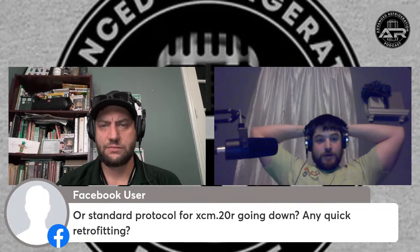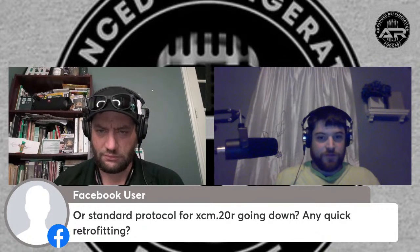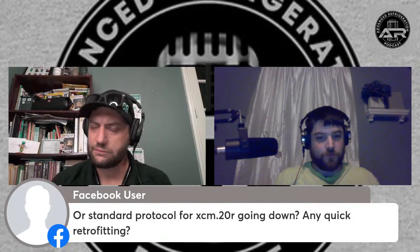If it keeps crashing, they could disable Walmart polling it all the time for their alarm system. But other than that, you're going to have to get a new controller sent out. Well, hold on. The ES1 is still going to take control of the rack, so everything's still going to go into defrost. No, if it's down, it's not going to. Yeah, but that's just the display, though. An XCM20R is the original Opus controller. Okay, so that is a predecessor to the actual ES1.